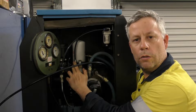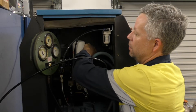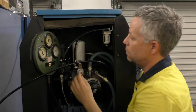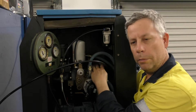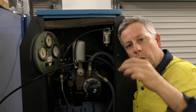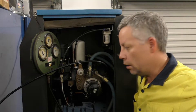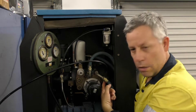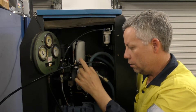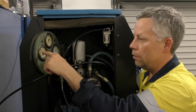What John was saying was to go through and find out where that pressure drop is, quite simply by taking the discharge hose off. This is the hose that comes straight out of the compressor. It sits behind the non-return valve, so the tank holds a little bit of air. Take it off, take out the oil filler cap which has a tiny little bleed hole in the middle which you can see, and it vents out through the side. As you crack this it lets the tank bleed down. What I've got in here is a fitting - just a BSP to JIC - which goes then to my test gauge.